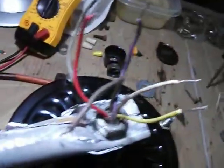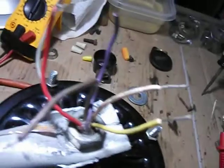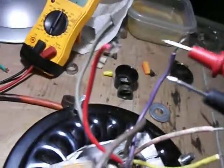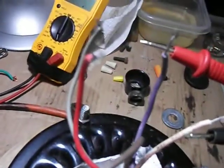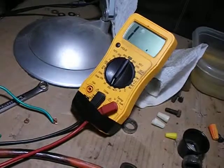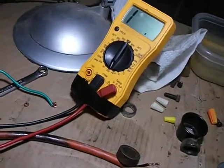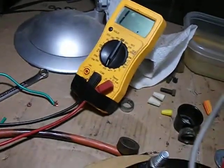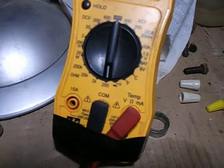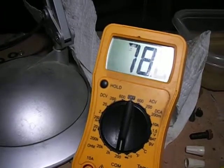Basically you just go all the way around the wires — you'll touch this one and then touch another one. You set your multimeter on ohms at 200 and work your way around these wires, touching one to the other. Right here is the highest ohm reading I'm getting off of this — that just happens to be the yellow and the purple wire.